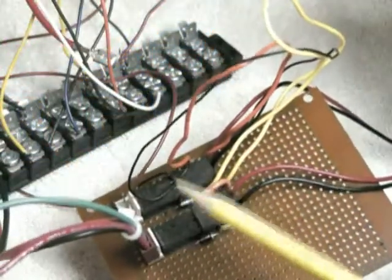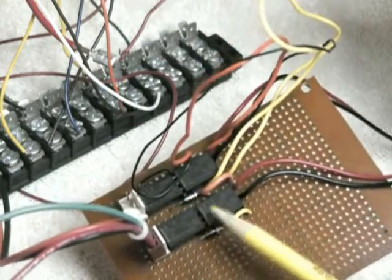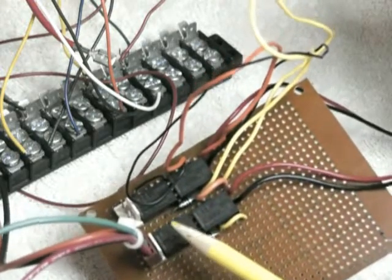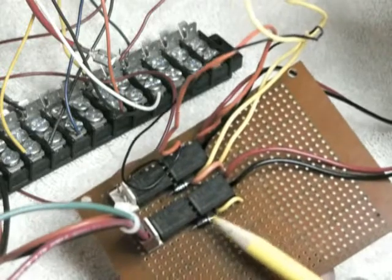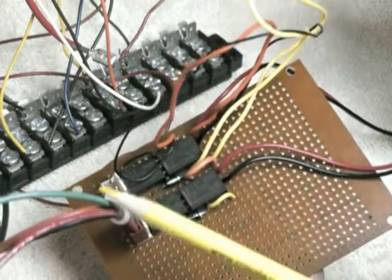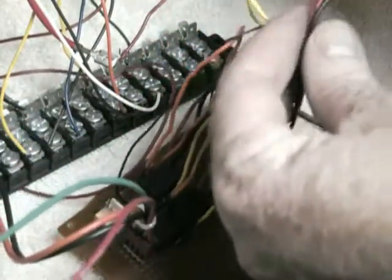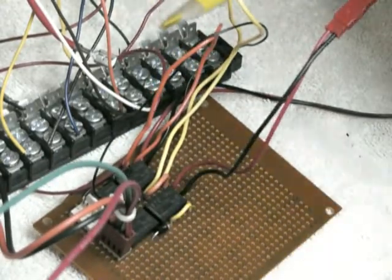This is one circuit for a drive motor and this is another circuit for another motor, possibly the steering motor. We have two relays — two double pole, double throw relays. For the first one I could have gotten away with a single pole single throw relay. I have a diode, so there are effectively three components supplying the switching logic. There's a connector that brings in signals from the Spot with power and ground, and on the other side male-female connectors that allow me to modularly connect the motor to the circuitry.